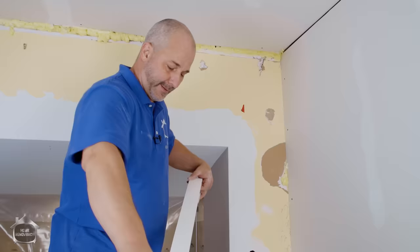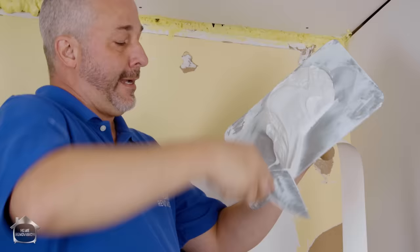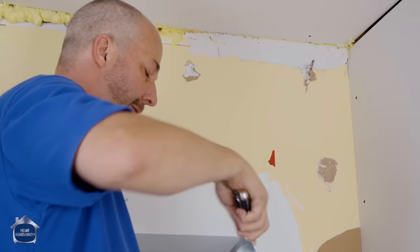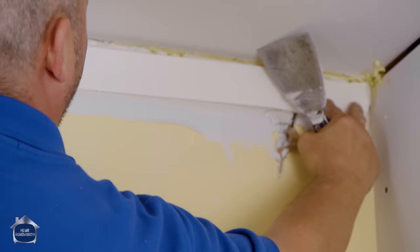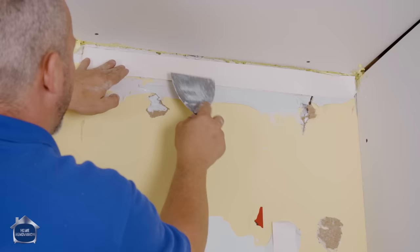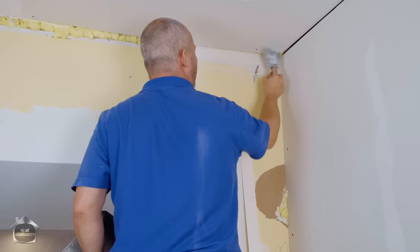I'm going to tape out the joint here a little bit. I've actually got about an inch gap from where the drywall finished until the ceiling, and the ceiling doesn't make it all the way into the corner — a nasty mess, and I made it on purpose to show you how easy it is to fix. Run your mud off the side of the knife. This foam does not react to the compound — it's not going to melt or affect it at all. I'm going to go what I call flat taping: just going on one surface and not going around the corner. Push that up as nice and tight as you want, then press it in. You don't have to wait until tomorrow to come back to fix it.